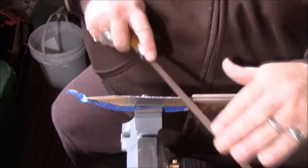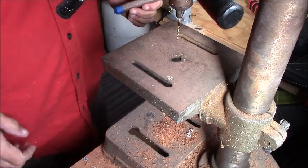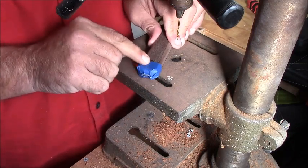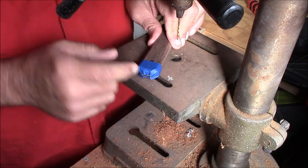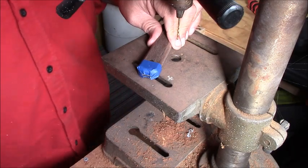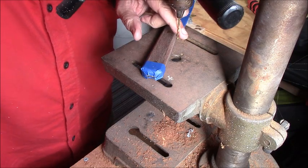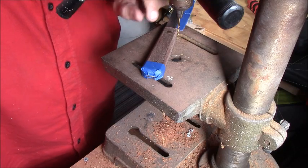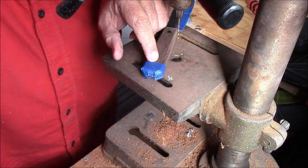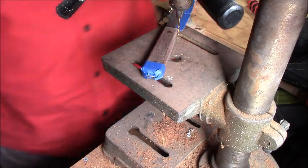Real glad we still have our Old Hickory. Okay, next part — this is going to be highly experimental. We need to put a lanyard hole in the back of this, so I've taped it up to hopefully stop the wood from splitting. I'm going to step-size it up — use a tiny drill bit, then a bigger one, then bigger again to get to the size I want. I just want to split the difference between the pin and the back so I don't mess up the pin and hopefully don't split out the back.